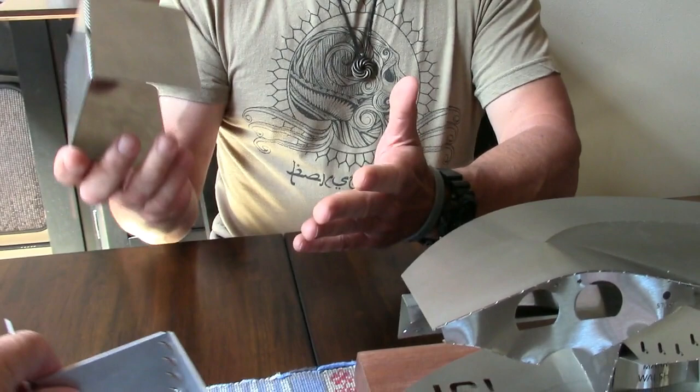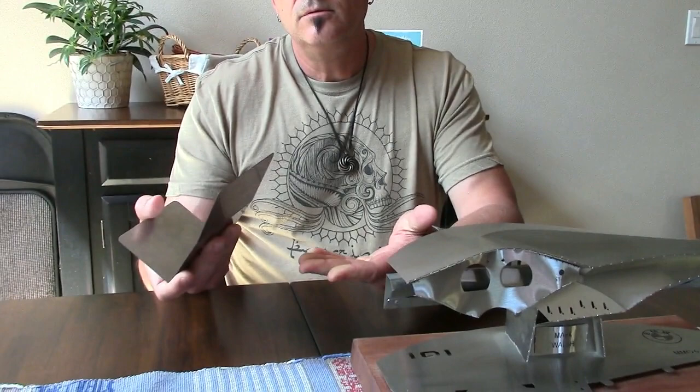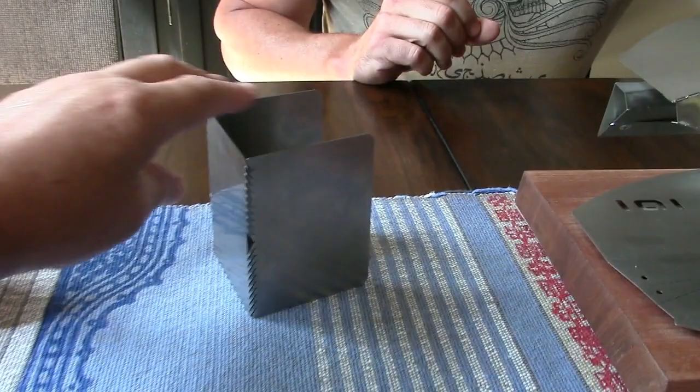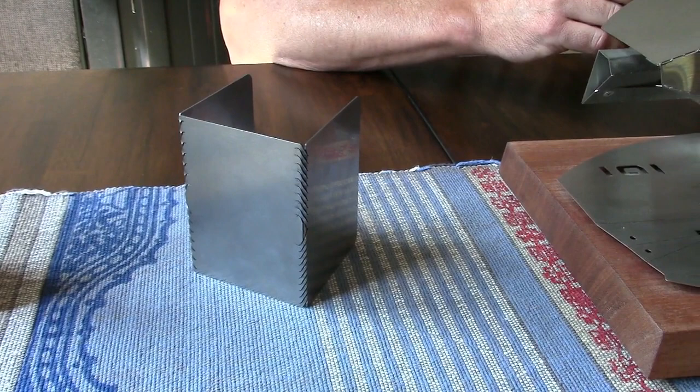This is standard 304 stainless steel, which is pretty easy to bend but not by hand — you need a press brake, tooling, a tool and a die, and a lot of tonnage. But I can bend it, and unbend it as well, and bend it back again with no spring back. You just took stainless steel, bent it, it stayed in position, then you bent it right back. With lower tensile strength materials, you get more cycles — it becomes like a hinge. Completely unheard of.